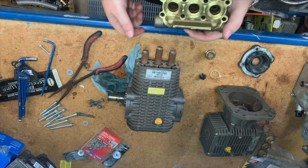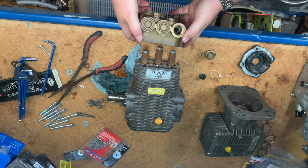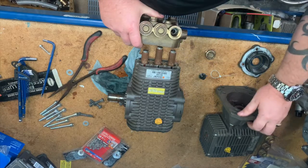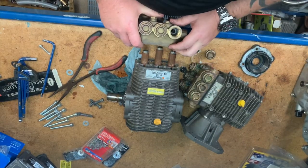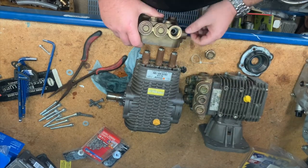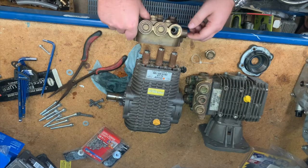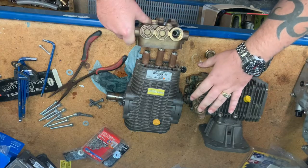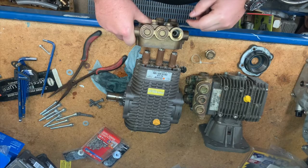The connecting rod for the plunger is bent, so it is shafted. Now you'll see a lot of pumps that will have a built-in unloader valve — pressure regulator valve, whatever you want to call them — built into the pump head itself. I would highly recommend not touching it. Unloader valves can go out infrequently; you might go through them once a week, once a year, or never. But when they do go out, you don't want to have to replace the entire head if it's moulded into the head. I don't have any here to show you, but I'll upload a picture to show you what you want to stay well away from.